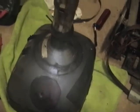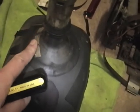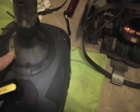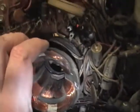That wasn't too bad. The trickiest part is that the yoke had fused to the picture tube. There's a piece of old tape here, and over time the adhesive from this seems to have kind of melted into the yoke. So what I had to do was put a thin screwdriver between the two and carefully pry it up. Here's the yoke itself. It's in pretty good shape.